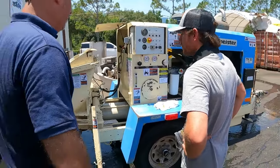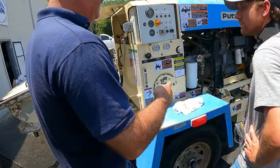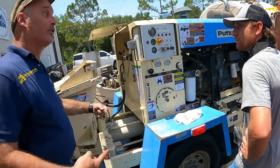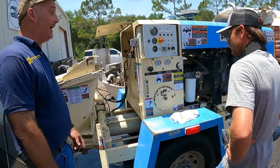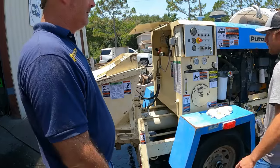So if it's getting hot, and you walk by it, you need to see what the temperature is to figure out why it's hot. Did you leave the fan on? Did the fan malfunction? The best way of getting rid of a lot of heat is you stop the drip of water in the water box and add new water. Then as that rod goes back and forth, it'll cool the rod down, which will return cool. It'll cool up real quick. And then you can put water on the hydraulic tank and start scrubbing it down, and it'll dump a lot of heat off quickly too.